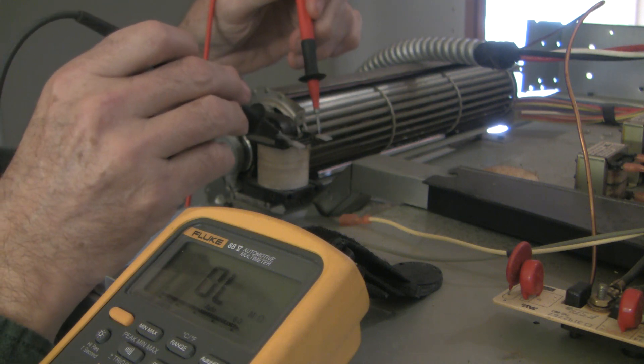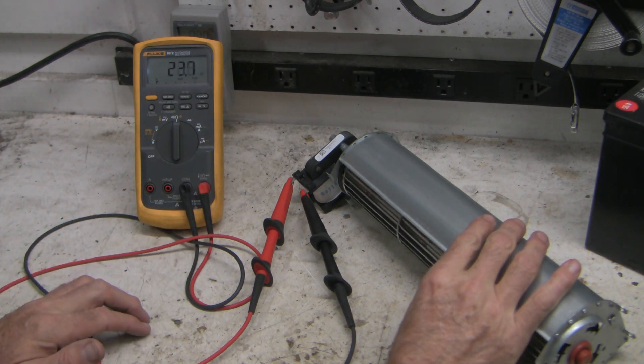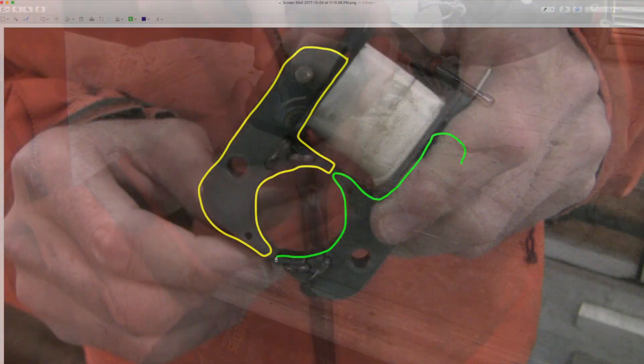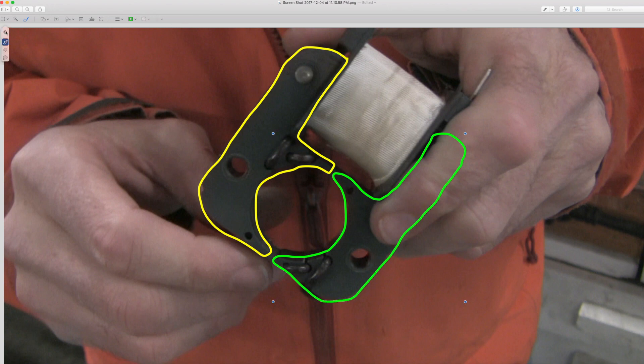In this video we'll show how to diagnose and replace a noisy fan in an oven. We'll demonstrate the function of a shaded pole inductive motor and go into detail as to how it works and why this little motor is the most common AC motor in a home.